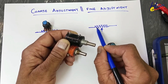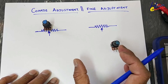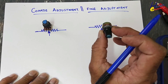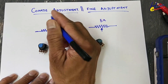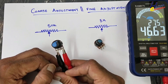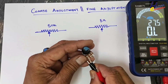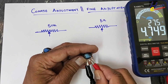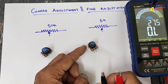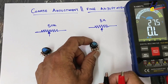The wiper taps the resistor on the resistive track through mechanical movement. There are different techniques to connect these potentiometers: series connection and parallel connection. I will demonstrate using a 5k potentiometer and a 50k potentiometer. The printed value is 50k but it measures 46k; the printed value is 5k but the physical value is 4.7k. For more precise adjustment, we can use 1k or 2k, which will provide more accuracy when using a single-turn potentiometer.